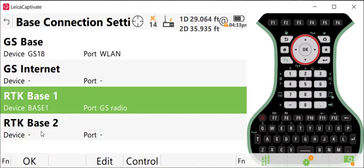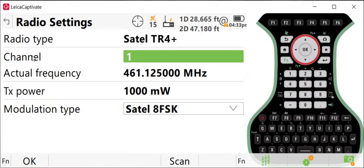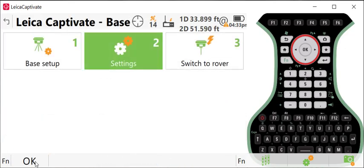And then the last thing we need to do is set our channel and our modulation type. So we do that by selecting control, and we make sure that the channel matches here with what was on our rover, and that our modulation type is the same, but we used 8 FSK on our rover. If everything's correct here, then we are ready to start our receiver broadcasting. So we'll press OK, press OK.